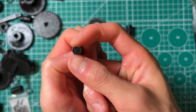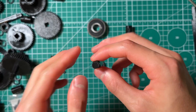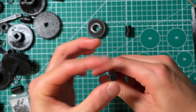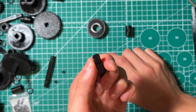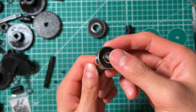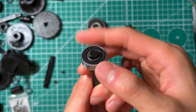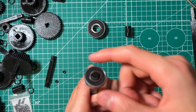The easiest workaround is to simply cut two flat slots out — the top is flat and the bottom is also flat. A good formula is that the remaining distance from top to bottom should be five-eighths of the total diameter prior to cutting. That's my sweet spot, but you should play around depending on your printer. Now you can see when I press it in it fits perfectly, the inside sits stationary while the outside rotates freely with just the right amount of friction.